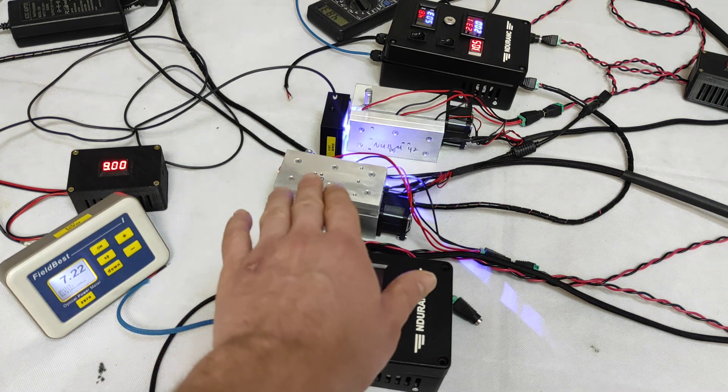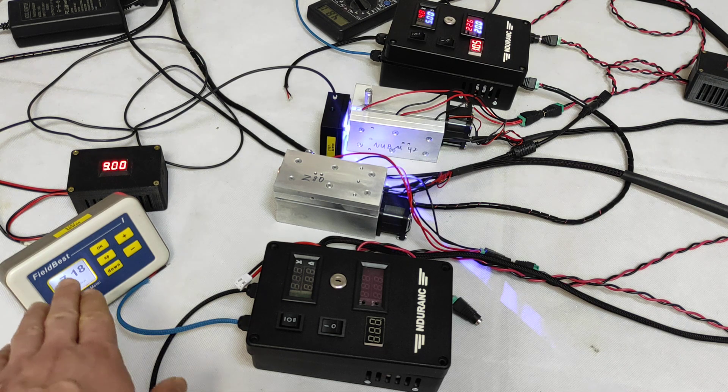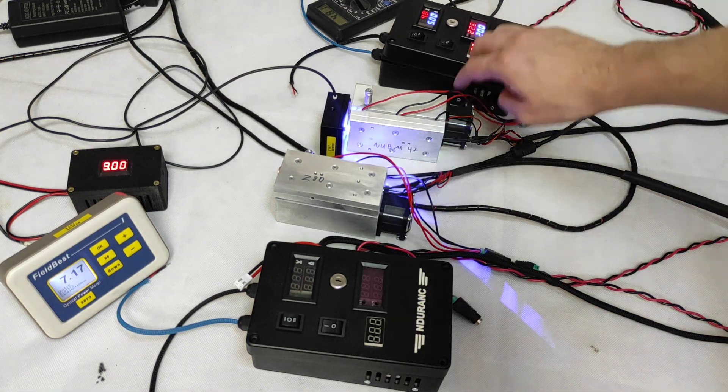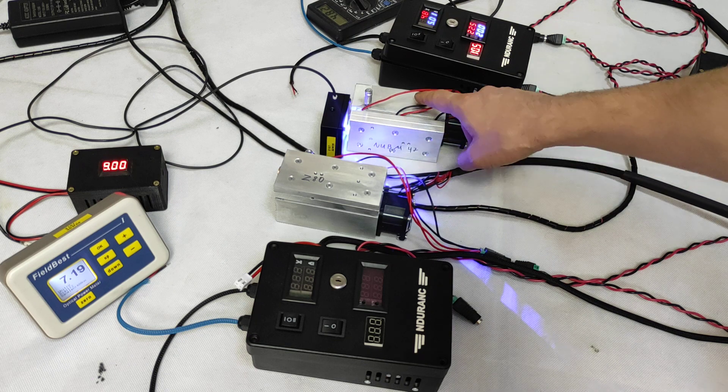Like I said, we have about 5% loss on the G2 lens. So the diode gives about 7.5 watts, and that's actually the maximum power you can get out of those diodes if you want to keep their lifespan at about 10,000 hours. You see that it's quite stable, and the temperature is stabilized too — everything's working fine.